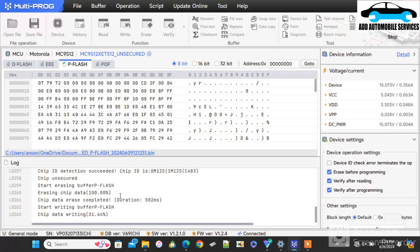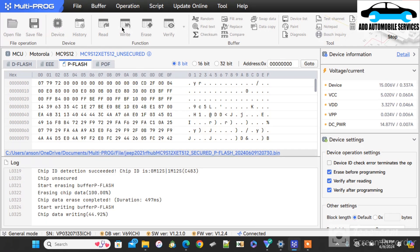On the right you can see my VCC is 5 volts and the amperage being used to read the data. It didn't allow me to use VDD — normally VDD is 3 volts, but I'm using 5 volts to read it because of the corrosion on the board. The EPROM also shares power with the MCU at 5 volts. When reading an MCU on a separate unit you typically use 3 volts. Most MCUs and EPROMs on vehicles use 5 volts. It's now at 45 percent and writing the data.